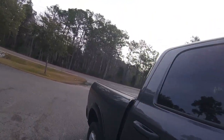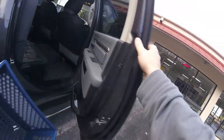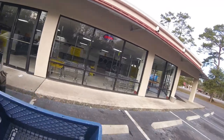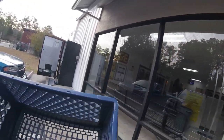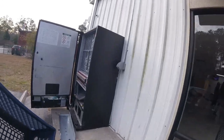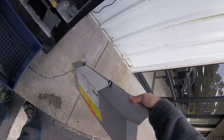I'm running back to the vending truck to grab an empty milk crate because I'm going to pull all the cans out of column four just to make sure there's no jams, things like that. For whatever reason, I don't know why it would stop not at the home position if there's not a jam. So let's go ahead and pull the cans out and take a look.